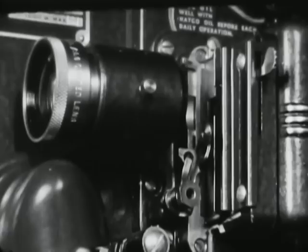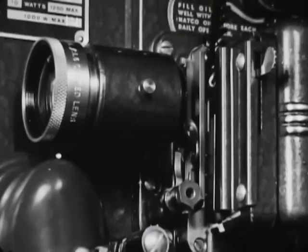The image is now the right size and brilliance, but there is fuzz around its edge. This is dirt in the aperture of the projector, which must be carefully cleaned before the showing — for the dirt is not only disturbing to see, but it will scratch the film.